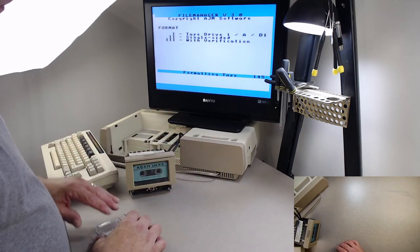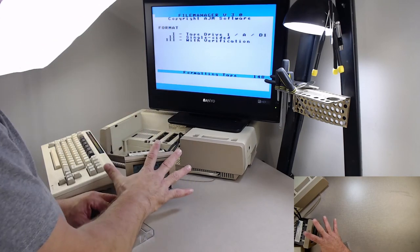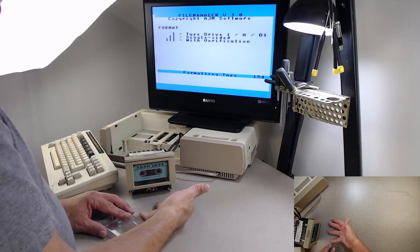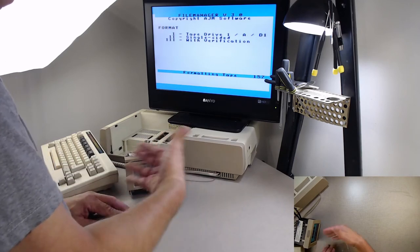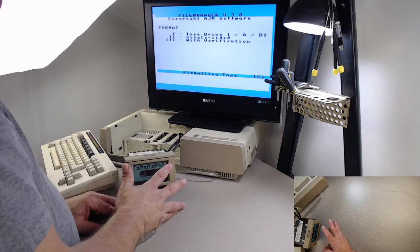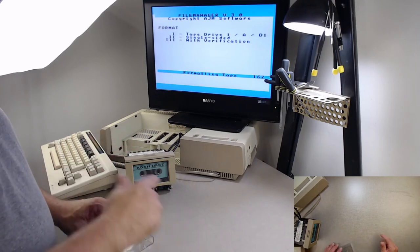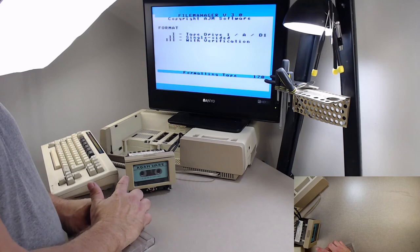What I do is, because I have the bulk copier that I can copy on, I can do three tapes or three data packs at a time. After I'm done doing a destructive, where I've changed things around enough, I take a bulk erase, bulk copy again, a blank data pack, format on them, so that I always start with a fresh format instead of using a data pack that's bad. If I get a data pack that squeals, and it consistently squeals, I get rid of it.